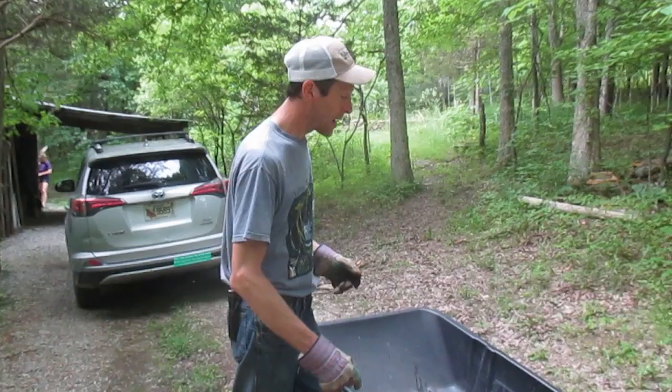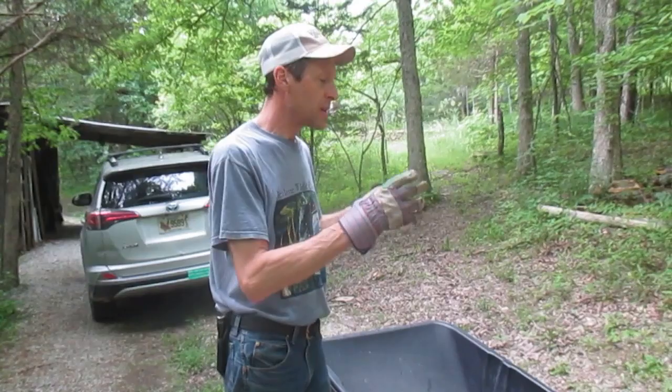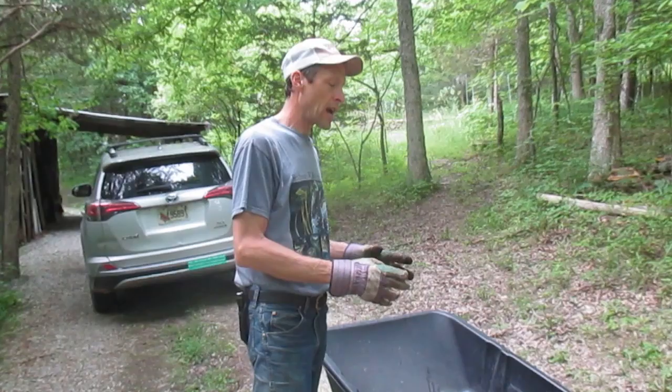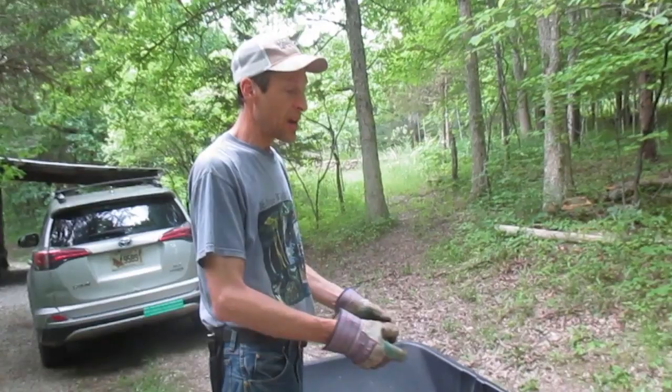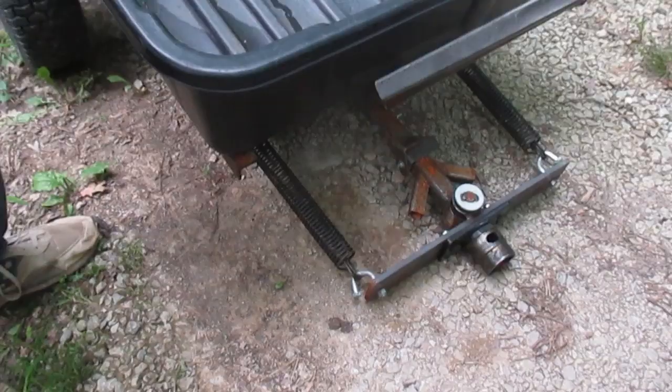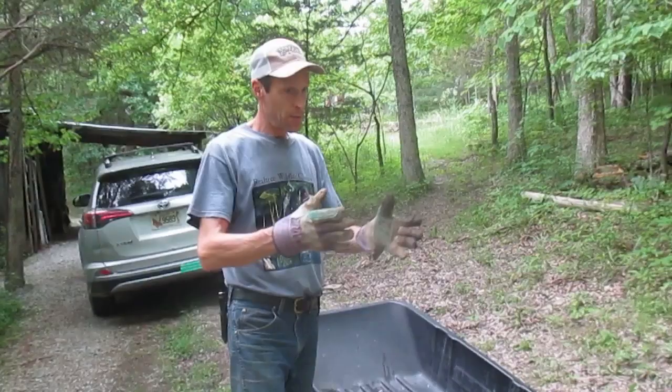The BCS Buddy cart has a design sort of like this. BCS America tried to take our utility cart design and kind of marry it with a PowerBarrow design, but the overall effect was something a little long and ungainly. And having a front mount barrow with a swivel joint in the middle, which is what we've done here, is really tricky, because when you're trying to push a load, particularly going up a hill, there's a good chance that it's going to jackknife on you. Think of backing up with a trailer. If you're trying to back up a hill with a trailer, the thing just wants to jackknife all the time.